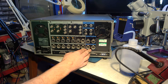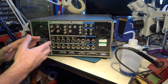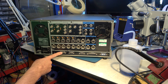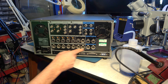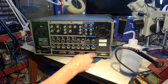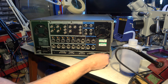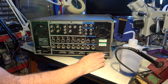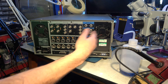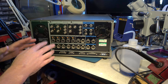You've got input and output for that. It only carries two channels, which is why there's two of them. There was a variant of Toslink that can carry eight channels, but that was a special version. There was obviously an optional control panel and remote controls in and out, and RS-232 serial, which was pretty obsolete even when this thing was built. And there's video control with a cover on it — I think that would be for controlling the analogue video performance, so you could adjust the time-based corrector operation.